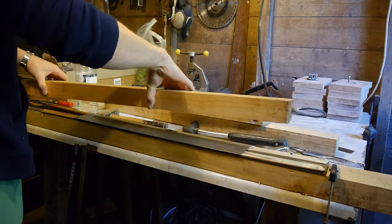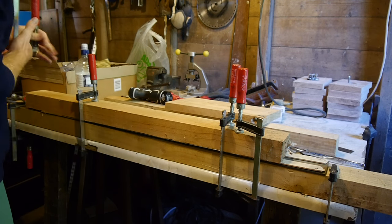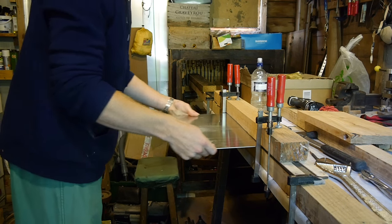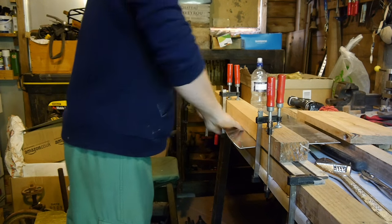There are six of them. The first thing I did was to bend the flat bucket panels into the curve I had to find in my design. This curve is the curve that the water makes as it falls from the flume. I did this to increase efficiency.